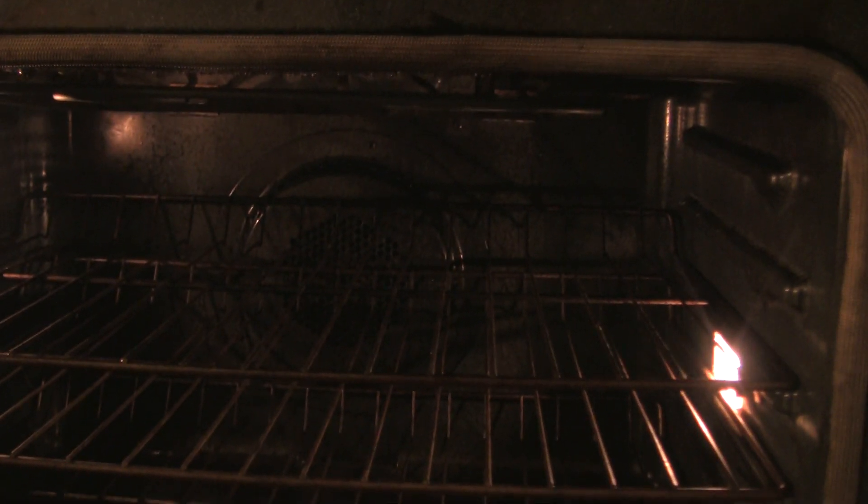In the last six weeks we've noticed a loud noise coming from where I think the fan is in the top part of the oven. Of somewhat more concern is that intermittently we've had a power shutdown where we get a PF message — power failure. In contrast with the thermal fuses, I'm able to restart the oven a few hours later, so it's a transient thing.